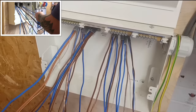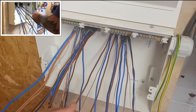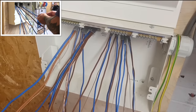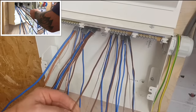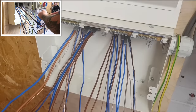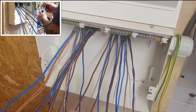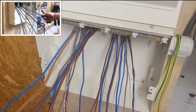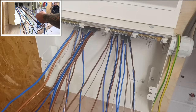So the way I do it is I'll strip it off and I'll do a tally mark only on the phase. But when I tally it, I don't just put all the lines side by side. On this, I've got a 5+5 here. So I'm going to put a ring at the top, which is the 32. Say it's my ring there. It's going to be circuit one, so that'd be quite easy, it'd just be one tick. Let me do this one actually, because it'd be harder.